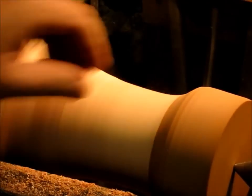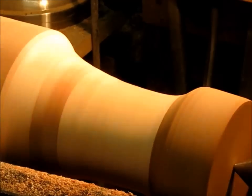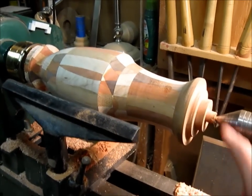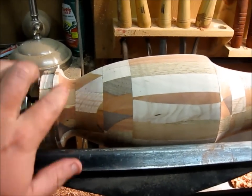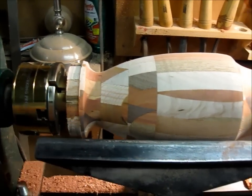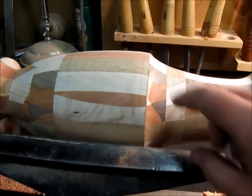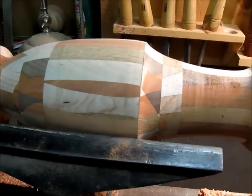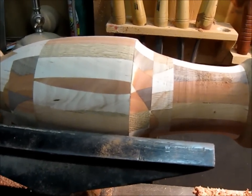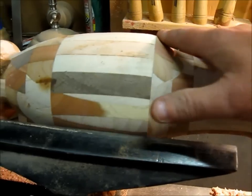That really smoothed that mahogany up — very good. I've got a nice stone shape on the bottom. I've got my tenon down here and I've kind of got the bottom shaped up. I believe I'm going to use a foot here — this will all be turned off and of course the tenon will also. But I believe I'm going to have a problem here. Right here where my cove starts — that's where I need to break that newspaper joint. This is awful thin right in here, so I'm not going to try to break it with a chisel.